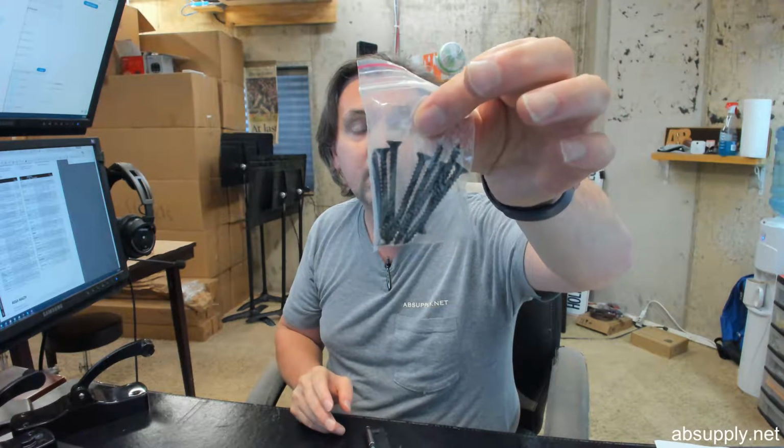In all honesty, these are the wrong screws. If it's a metal door, you're going to use machine screws. Obviously, if it's a wood door, these would be acceptable. But drill and tap is how you'd go about it with a hollow metal door and frame. It would really be ideal if it was all through bolted as well in terms of the head case itself. We can help you with sex bolts or binding posts for that.